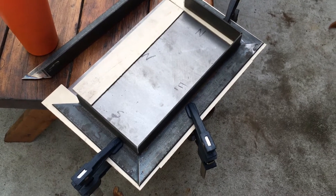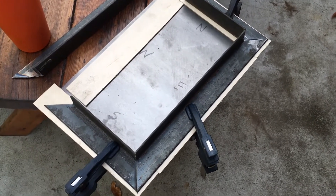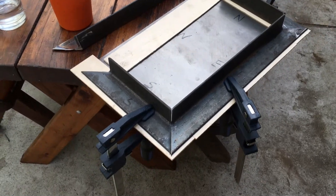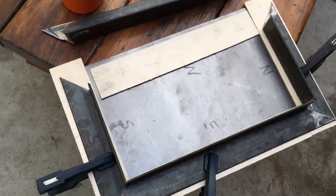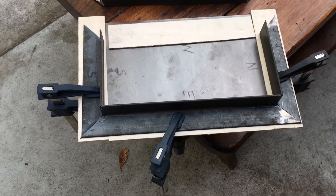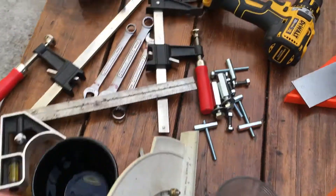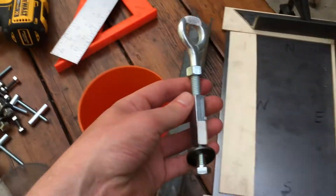Basically we are making a little flange. I'm trying to get all these little bits of angle iron nice and square. Then what we're gonna do is we have this piece of 10-gauge plate steel, and we're actually just gonna drill some holes in here and run these guys through it.